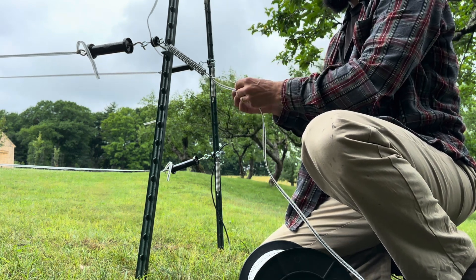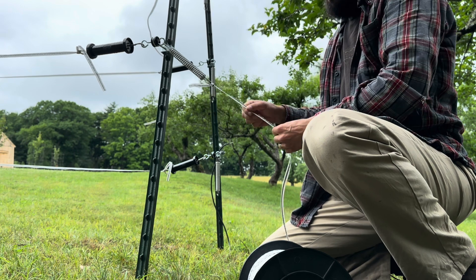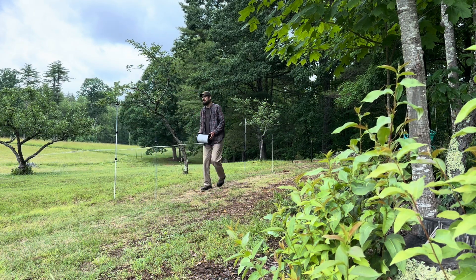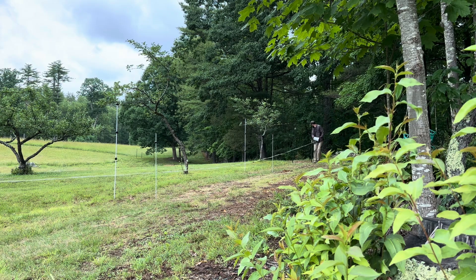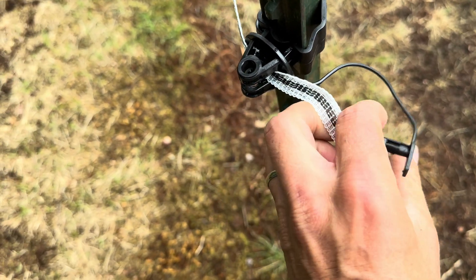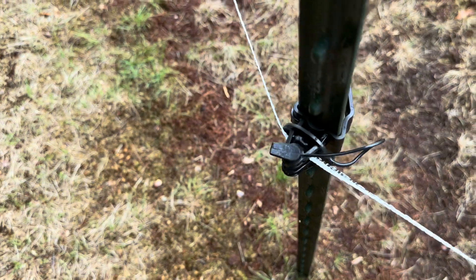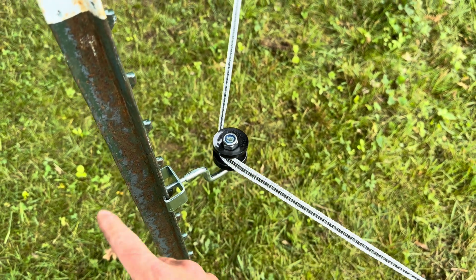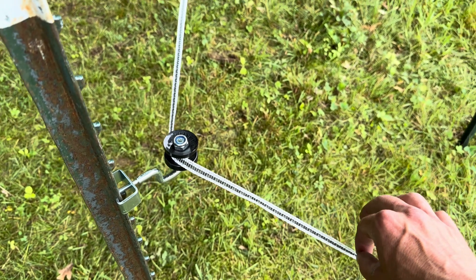I've just been tying the tape at the ends in a nice tight knot. There are other ways to make these connections, but Wellscroft said a good tight knot will work just fine. I've got a T-post at every direction change in the fence, and I'm using a pin-lock insulator on these T-posts. At the corners we have a more abrupt change in direction, so these insulators mounted to the T-post let the tape come right around a 90-degree or even sharper corner.